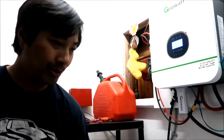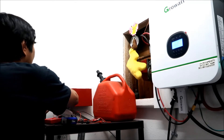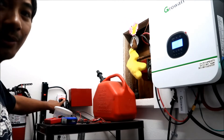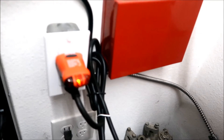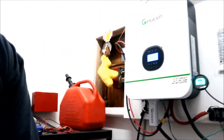You can't have it done at both the main panel and the sub panel. The problem is when it's in inverter mode it needs to be bonded, because it's got a floating ground — meaning it's not properly grounded, it's just an open ground. If I plug my tester into the outlet, only the middle light lights up. If only the middle light is illuminated, it means there's an open ground.